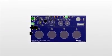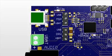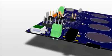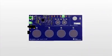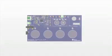The board supports powering from either a USB port or bench power supply. The power source can be selected using the two 3-pin headers next to the power ports labeled MSP and DRV. Out of the box, simply insert the included USB cable into a computer or other USB power source and begin playing. On the other side of the board, there are two actuators.